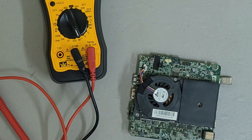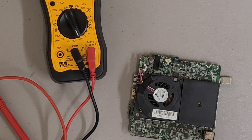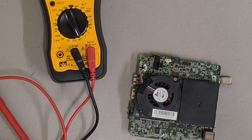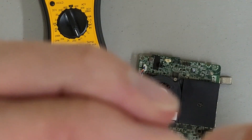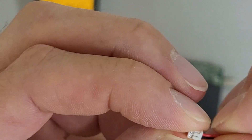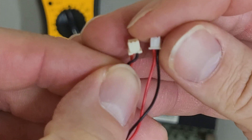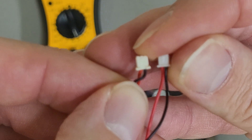These are a similar style of crimp pins to your Molex connectors on a standard power supply. Make a mental note of which way these go, then just swap them around to get the correct orientation. You should be able to push them in until they click into place, or if they don't click, if you pull on it gently it'll stay in. Now we'll compare that to the original battery — focus, camera — and you'll see that the wires are in the same order.